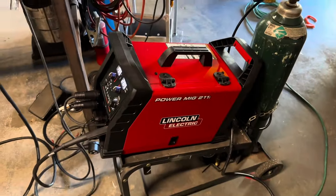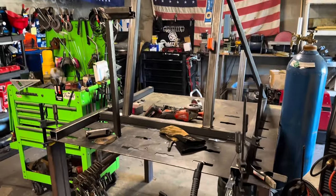I hope you guys enjoyed this quick little review. Hopefully if you guys get a hold of one of these machines they serve you well. I'm going to get ready to go ahead and put her to work finishing out this outboard marine engine stand. I know there are a few features some people aren't going to like. The fan stays on at all times when this machine is on, unlike the Millermatic 211 where the fan comes on while welding, cools the machine down, and then shuts off once it's cool. It's kind of a good thing the fan stays on so you don't forget to turn off your machine at the end of the day. The second thing is what Millermatic calls soft start — when you hit the trigger it slowly feeds out at first. Lincoln's got a similar style to it. It's supposed to stop the sudden arcing when you're making contact with your material — the popping before it starts establishing an arc.